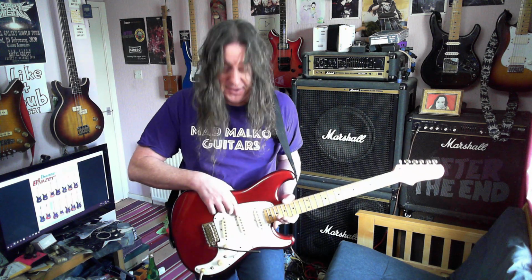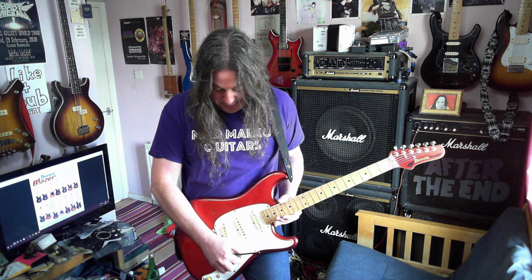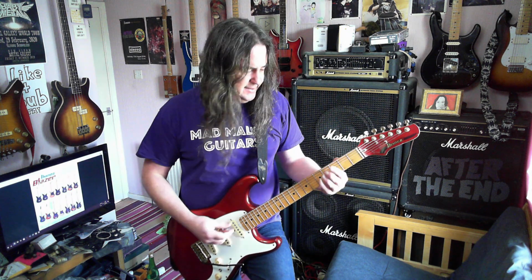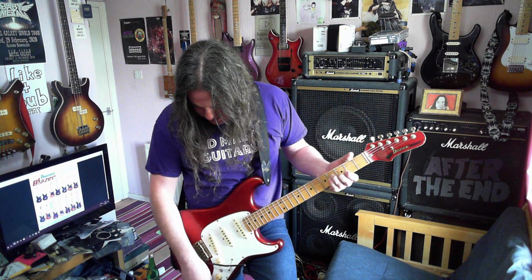Yeah, so as I said, just go with the phase there. The phase reverses the middle pickup. So if you've just got the middle pickup selected and volume turned up, and you reverse the phase, it does still reverse the pickup, but because you're just hearing it, the pickup doesn't really care which way it's round. It's only when you put two or more pickups together that they can be out of phase with each other, because you can't be out of phase if you're only one thing. You can't be walking in opposite directions if there's only one of you. That makes sense. Maybe not a good analogy.